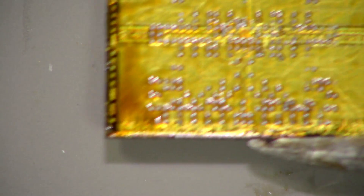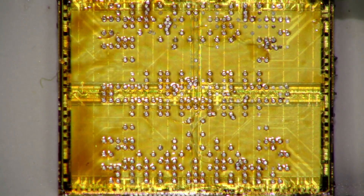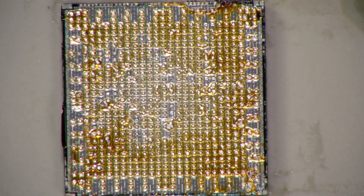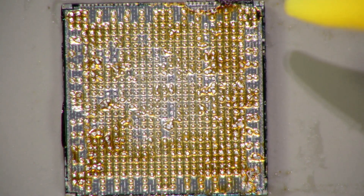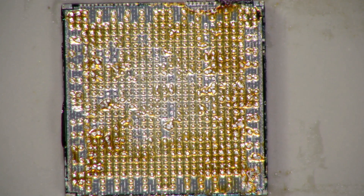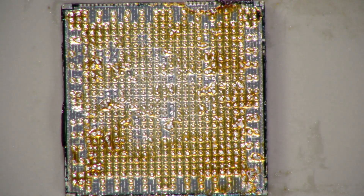Here's the other large one, which I wasn't sure if it was different. Unfortunately it's not — that little strand is from my cotton bud I used to clean it. I think that's identical. Ken's got two of those to play with. It almost looks like some row and column arrangement, as if it's some programmable logic device or something. It looks like it's impossible to tell unless you get all the balls off. Ken, I'm sure you'll get great photos of these and strip them away — you need really nasty chemicals when dealing with dies like this, and proper fume extraction and safety measures.